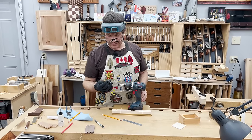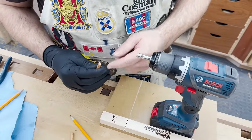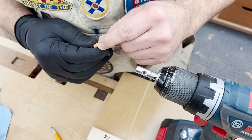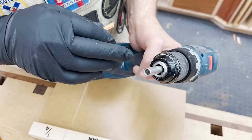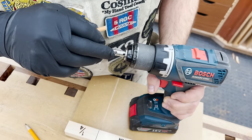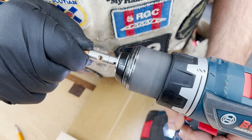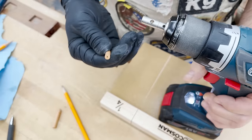Now the hinge works based on the precision of the drilling of the dowels. We're going to put a 16th inch diameter hole and we're going to go in about 1/8 of an inch into the end of each piece, and it's got to be dead center. So this is my jig. I made this, developed this 35 years ago, and it simply has a 16th inch drill bit in there that as I push it down in here, it'll engage and drill a hole and come out perfectly centered.